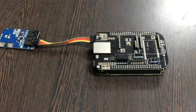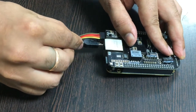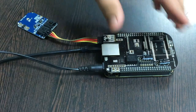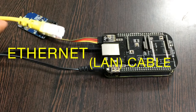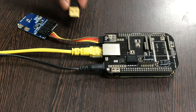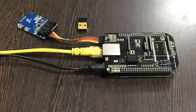Next we need to power up the BeagleBone Black. First, take this mini USB cable and gently insert it into the USB jack. Then we require a 5-volt adapter — gently insert it into the power jack. For an internet connection, we can use an ethernet or LAN cable inserted into the ethernet jack. Alternatively, there is an option to use a wireless nano USB adapter. Now all the connections are set.